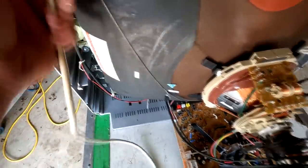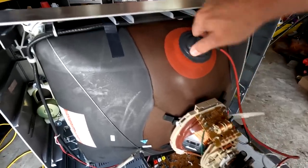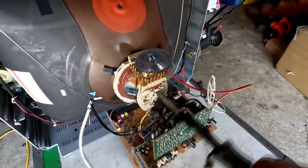We've come to the dangerous part — you're going to see me discharge this tube, but I need to warn you the way I discharge it is probably not the best way for this CRT. I'm doing it to protect the hardware, but this particular Toshiba does not have any kind of bleeder resistor built into the anode system at all. So when you go in to discharge this CRT you are always going to get a large spark. We've got a nice big ground strap on this set. I'm removing the cap first and then discharging — I can hear electricity in that cap right there.